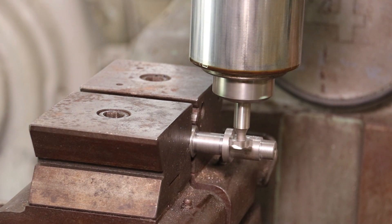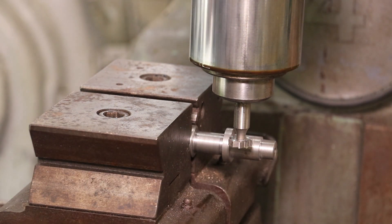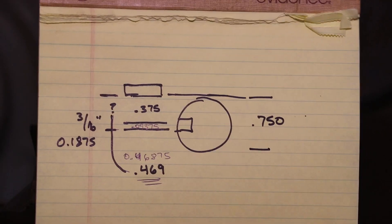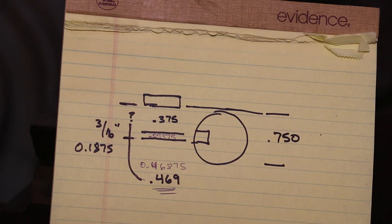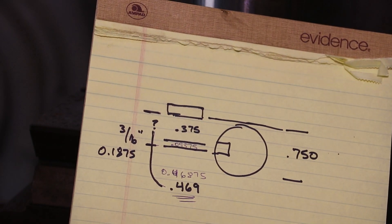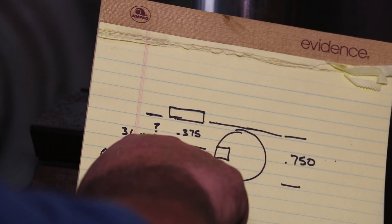So I know right now I'm within five thousandths of an inch off the top of that. What I'm going to go ahead and do is zero things up here, and I'm going to go down another five thousandths — that should be zero on the height. So right now the bottom of this cutter is zero, it's flush with the top of this. So now we've got to do some math to figure out how far down we need to move this cutter to get it into the center. So a little machine shop math lesson here — my cutter is now currently, the bottom of it is flush with the top of my shaft. I need to put it into the very center. I know that my total diameter of the shaft is three quarters of an inch. Half of that's three eighths, which is 0.375. So when I move my cutter down 0.375, it's going to put the bottom of the cutter on the center line.